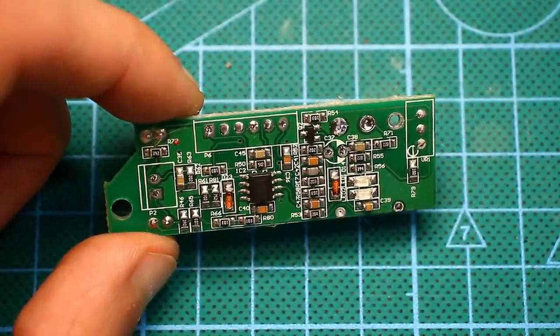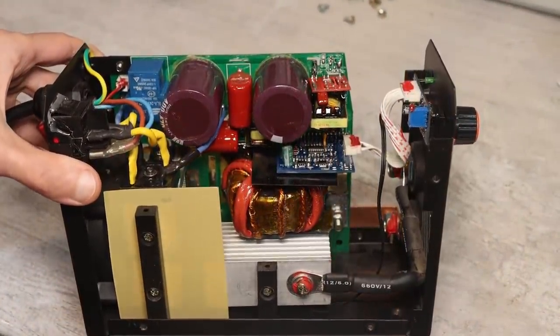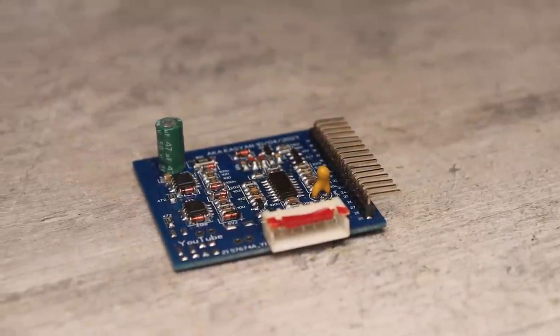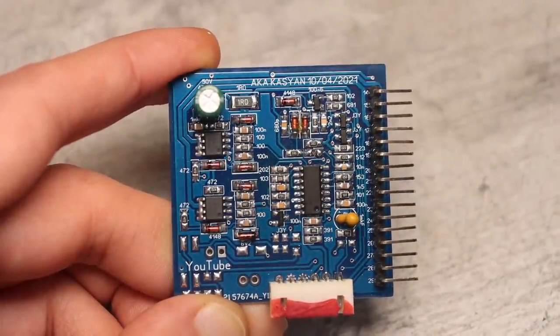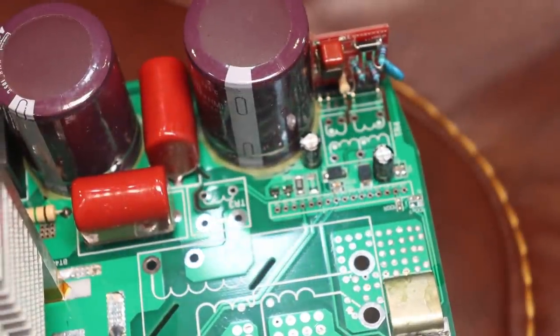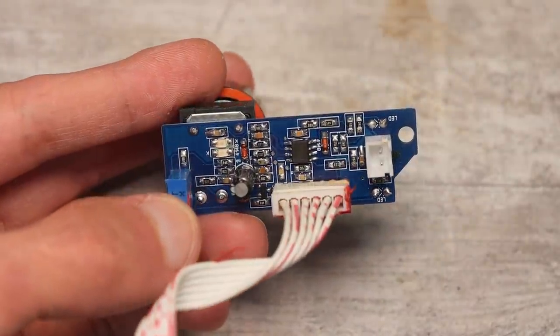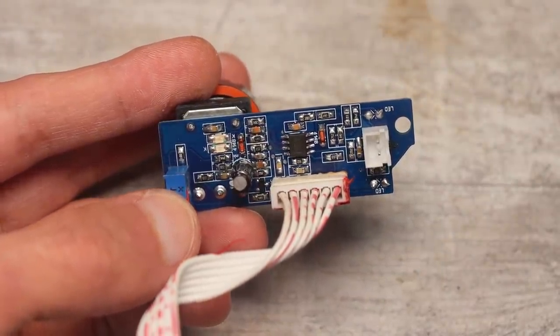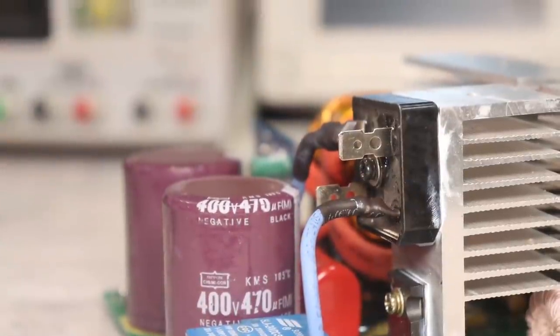Nothing prevents adding another op amp, which will monitor the voltage at the output of the inverter through a divider and work with a PWM controller through a single feedback line. In general, it is possible to organize voltage stabilization with the ability to adjust and stabilize the current, so it's worth working on this direction. All that has been said is just thinking out loud.